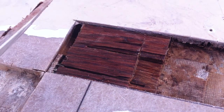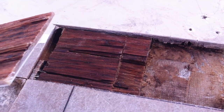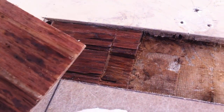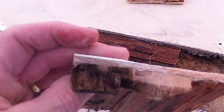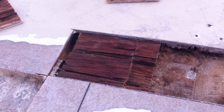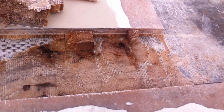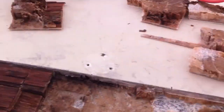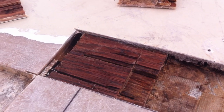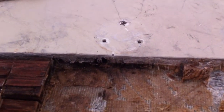As we've talked about before, unless you're willing to cut it open and deal with it, leave it alone. Don't pour epoxy in there or try measures like that — it really doesn't seem to solve the problem. Just leave it alone. Nothing really bad is going to happen; it's just a little springy. That's the deal — that's why you're going to see this mixture of plywood and balsa core, because theoretically where the plywood is, that's where they're going to be screwing in.